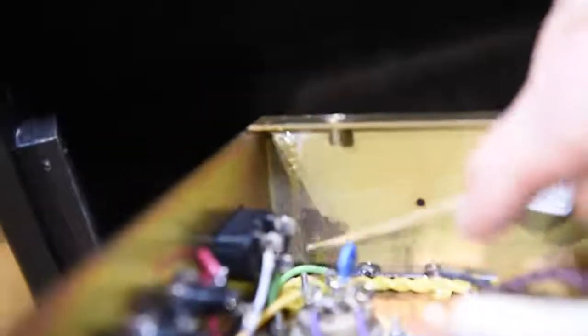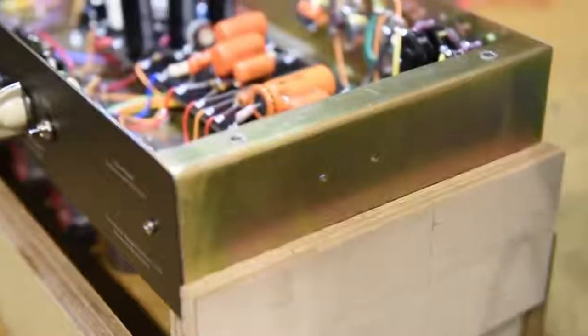Another thing to note is where other big name companies choose to simply fold their amplifier chassis together, Ceriatone actually welds all their seams, as you can see here. This makes for an amplifier chassis that's very flex-free, robust. It's designed to last and last and last. In addition to being welded, the chassis itself has this fetching golden hue, which is cadmium plating. This prevents rust and corrosion from destroying the amplifier chassis.